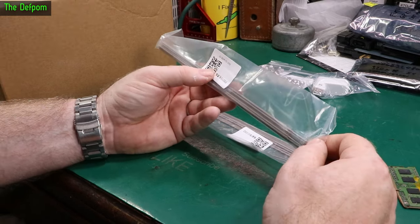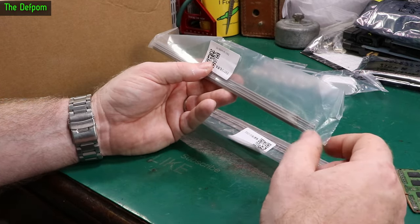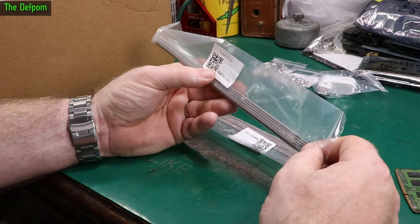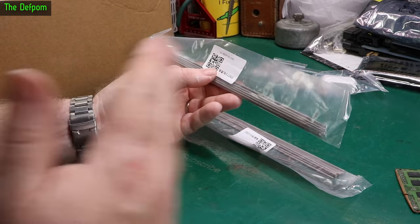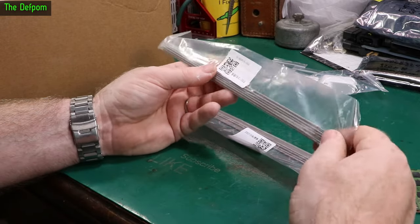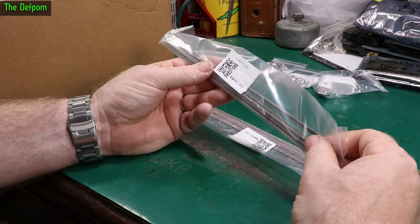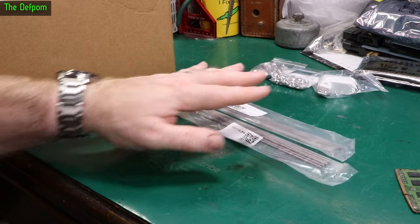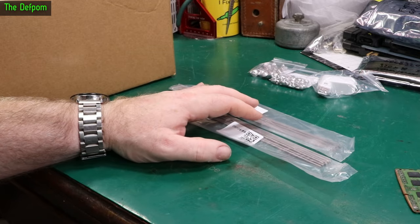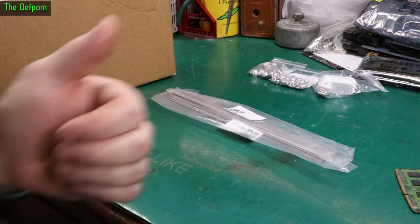These were doing it, but I tried between these and the MIG welder. The MIG welder is slightly thinner — 0.8mm wire — so it did a slightly better job, but it takes more effort. You do off-and-on with the MIG, which lets you avoid burning holes through. Whereas these rods are a bit harder to stop-start — once going you want to keep going, which tends to burn holes. So I've ordered more of these since I've only got 20 left. I used 30 in one job. I'm going to have a stock of them.